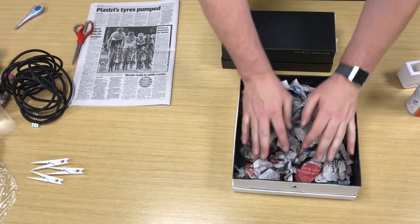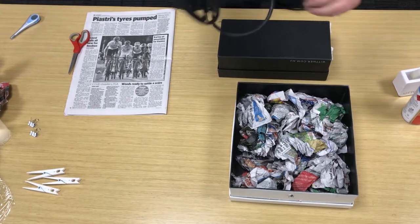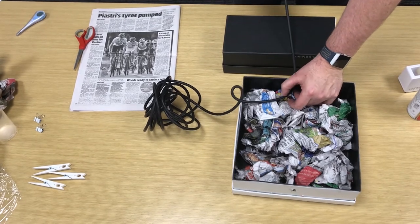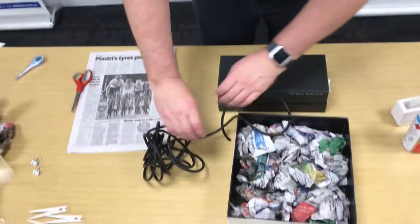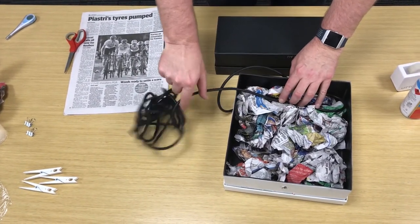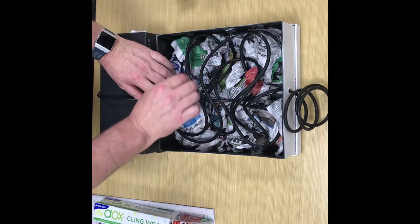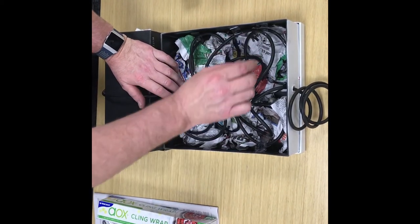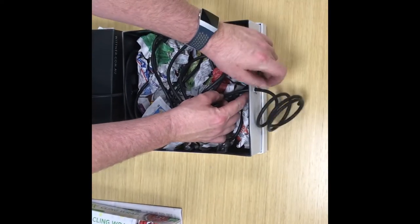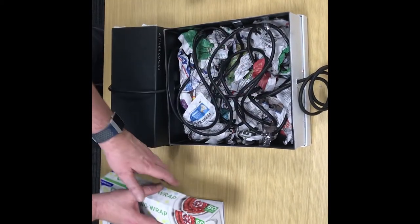We're ready to start with our solar water heater rubber tubing. We get our five meters of rubber tubing and thread one end through one of the holes at one end, pulling about this much through. We then evenly spread the black tubing out on the bottom of our solar water heater. We've laid it out nice and flat, then we put the other end out through the hole at the other end. Now we're ready to keep all the heat in our solar water heater.